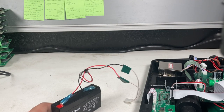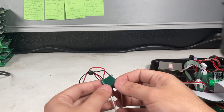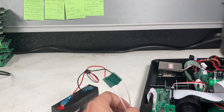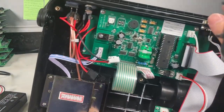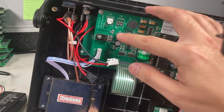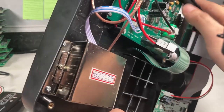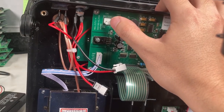What I think is, and I didn't make this battery, the other battery that was used, the person reversed the polarity and put the ground and power the wrong way around. So it shorted, and the capacitor blew on this one. So the circuit's well built, where power was drawn here, and the capacitor sacrificed itself so the rest of the board doesn't die. Because only one of them is blown. I replaced both of them, but only one blew. So it's actually pretty well built, because it was able to sustain even the short.